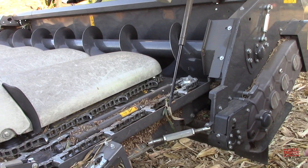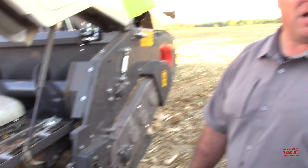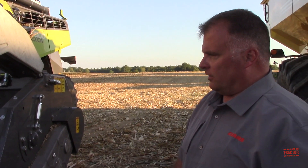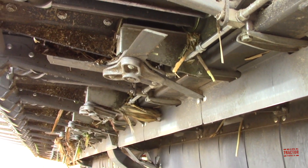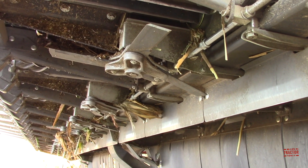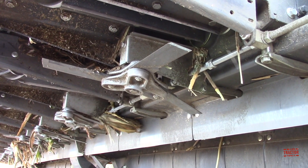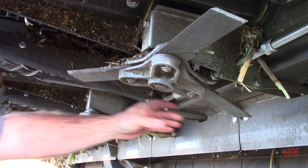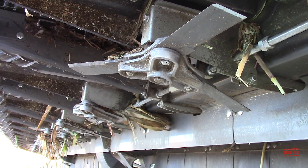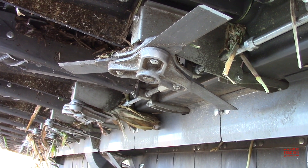And this is actually a chopping corn head, so we're continuing with our tri-blade rotor. The advantage of the tri-blade rotor is we get 50% more chop per revolution than two-blade choppers, so we're getting more chop going on down underneath there. That's what differs us from our competitors — our three-blade rotor. Here's the tri-blade rotor right here — 50% more chop per revolution. It's going to help us resize the stalks better and give us a smaller particle out there if necessary.